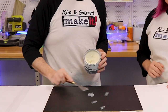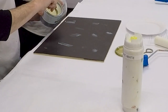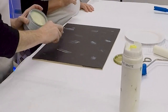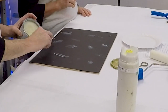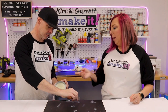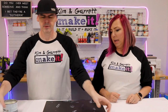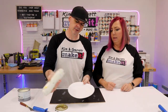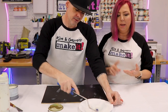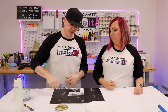You're going to want to start with a painted or stained surface — this one's painted, just black on some MDF. We're going to use some chalk paint wax and a little spatula, just give a little scoop, put it in random places, rub it around — random places, random thicknesses. Anywhere that the wax is placed, the paint on top will not stick to your piece, and that's what will show through. The thicker your wax, the easier it's going to be to rub off after painting. Any clear wax will do — Minwax brand or even Annie Sloan — you don't need special chalk wax. Any acrylic, latex, or chalk paint will work, and I think it even works with spray paint.